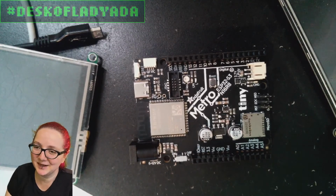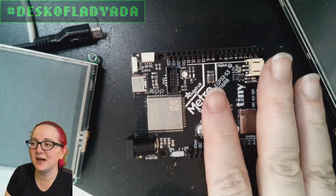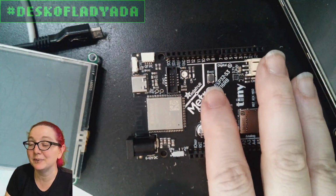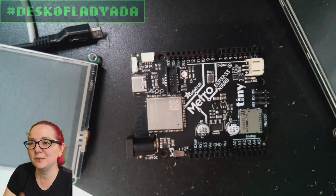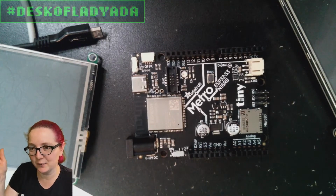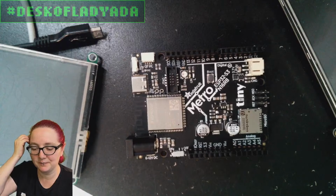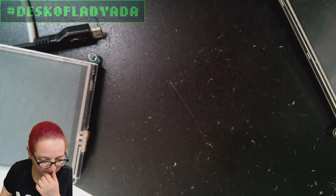Learned my lesson, though. What's funny is that when we tested the Rev A on CircuitPython, it was hard faulting because of the pin misusage. But because we'd been having so many weirdnesses with the S3, I thought it was a different bug that I was seeing. I didn't think it was related to the Octal PSRAM. Lesson learned. Okay, and then some other stuff.